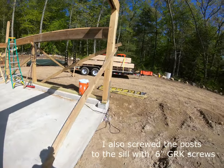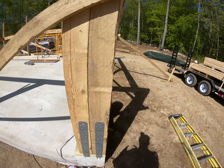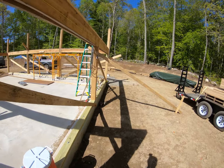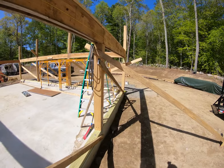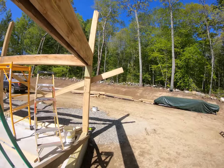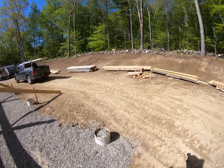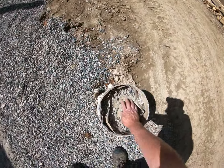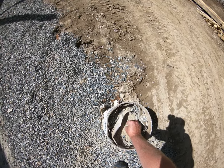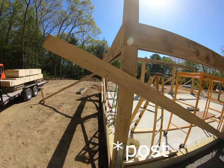You know, the pole barn I built 15 years ago, I just used the post bases like you get at Home Depot for 6x6 with the bolt coming out of the Sonotube. That's what I'm going to use back here on the back for the posts. Clean this off. It'll just be a post base and then a nut on that, and then it gives you something to attach the bolt to. But what I really wanted to show you was, let me get a ladder.